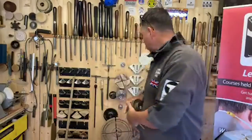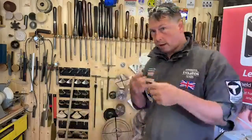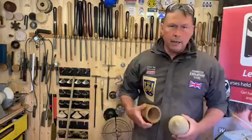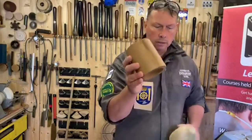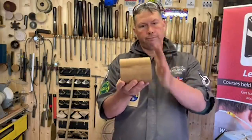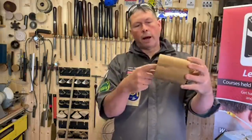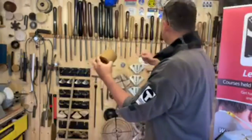But if you don't have a chuck, then jam chucks, that's the thing. So we're going to break into another question while I'm answering this one. Jam chucks, again, we've used them on the fruit making. So there's a jam chuck that would be a chuck for making wooden apples and pears. That can be used on a faceplate, so you only have to use your imagination a little bit. Solid piece of timber, screw onto your faceplate, and then hollow out. Keep a central hole all the way through so you can use your knockout sticks.